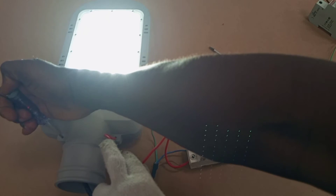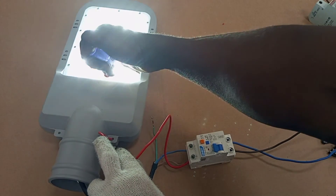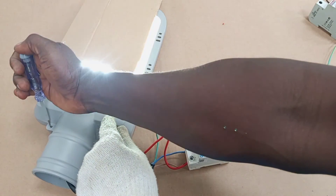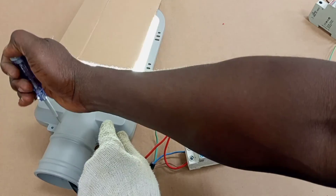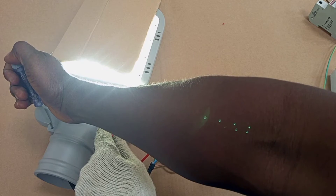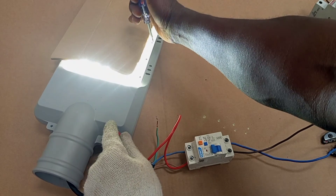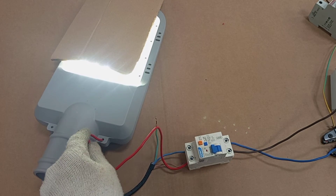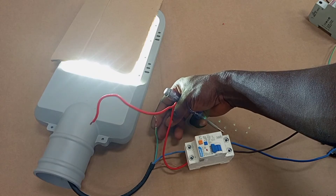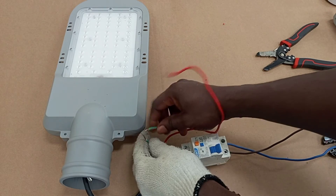You can see the tester is lit. Let me cover the light so you can see the tester clearly — it is lit. Only the painted or sprayed parts will not shock you, but if you touch the screws or any unpainted metal area it will shock you. There is an earth fault, the whole body of the load is electrified, but the RCD cannot operate because the protective conductor is not connected to it.